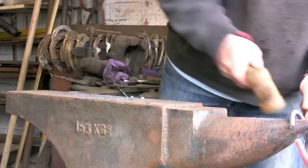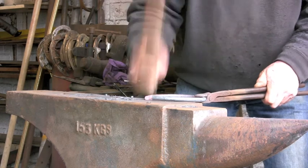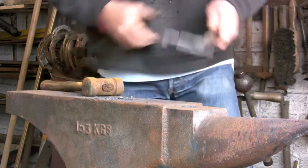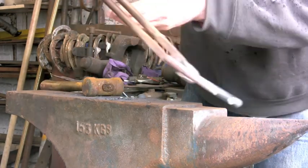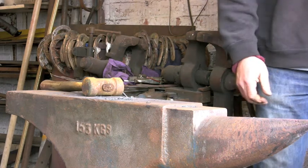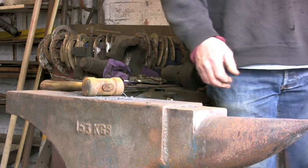So we're just going to open these up a little bit. When you put your first scarf on, use the heel of the hammer. It doesn't need to be anything special, just a quick tapering down. Just a rough surface — you don't want it smooth, nice and rough, so the two edges can sort of meet together.